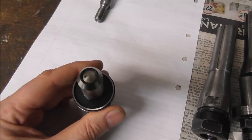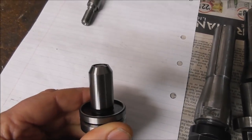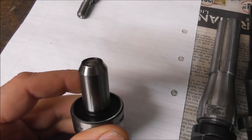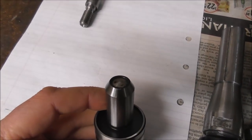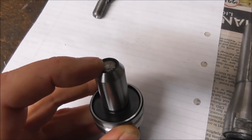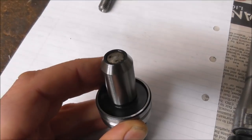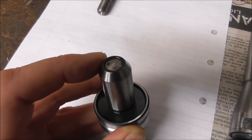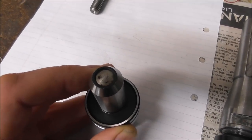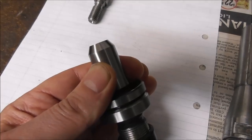In my last video I talked about having dedicated TTS holders that don't have a hole through them — not tubular but solid shank — and this should allow you to grip them more securely and use them for bigger diameter cutters without the same pull-down problems. What I meant was: just bore an absolute minimum out of that hole. You may be able to use a reamer, but the steel is hardened and tempered — it's probably safer to bore it with a very hard boring bar, tungsten carbide or high-grade high-speed steel — just bore out a couple of thou so it's parallel and round, then have a light press-fit steel insert. That way you've got a solid shank that allows you to grip your TTS more securely.